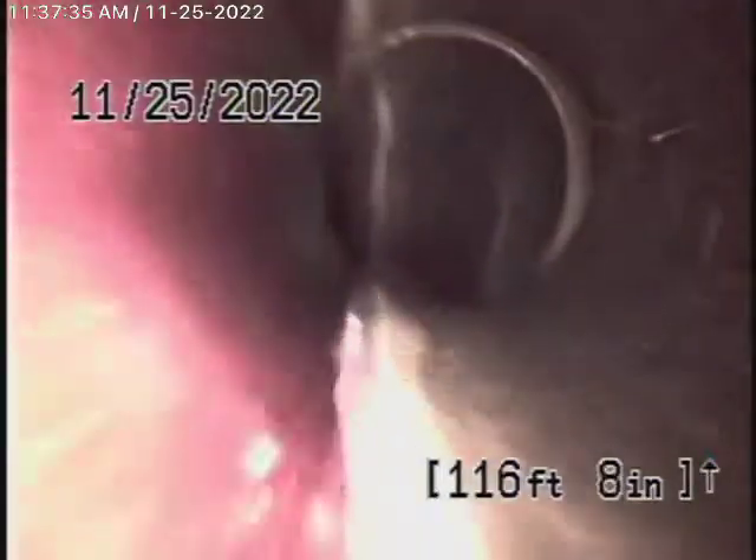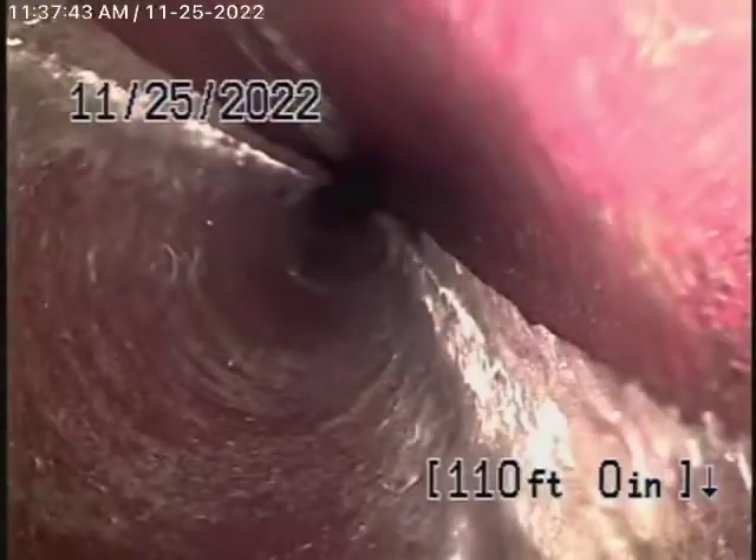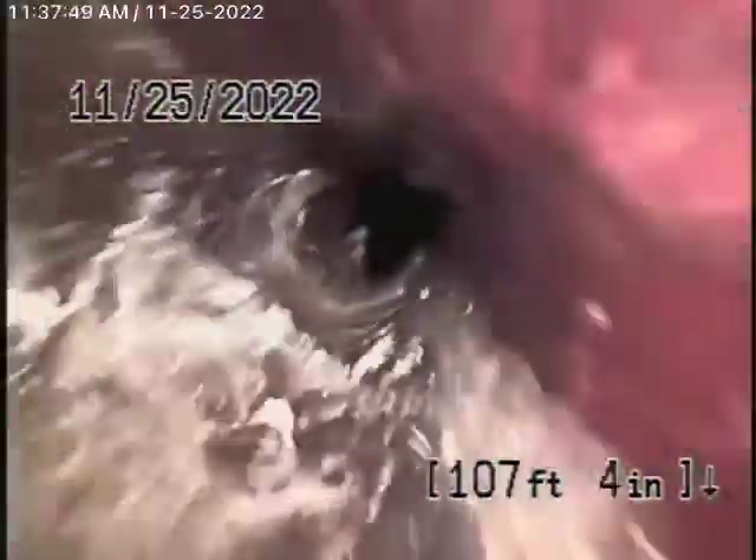This looks like it's in pretty good condition. You see slight little dislocations in a clay pipe — that's very common, that's what you're going to find in a clay pipe, especially near the city connection because these are cement joints. In my opinion, that all looks like it's in pretty good condition. It comes onto the property as a four-inch clay pipe.